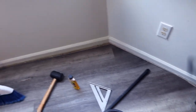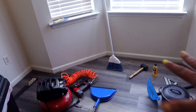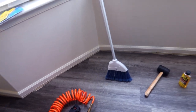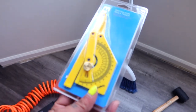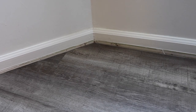Let me show you — and excuse the mess because I am working. You can see here there is a bay window, so there are some funky corners going on here, and we need to know exactly what those angles are so that we can cut the proper miter angles. I'm going to be doing that with my protractor angle finder.